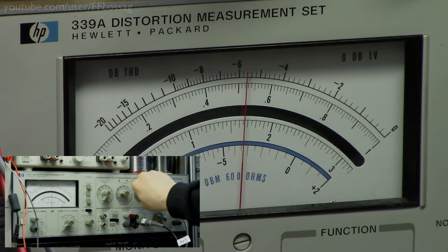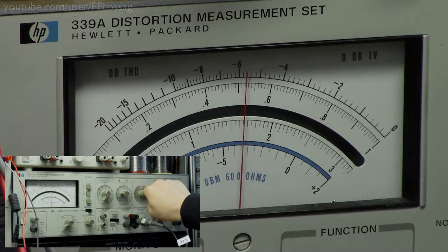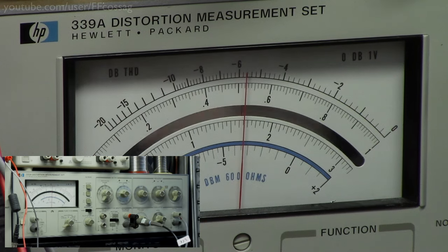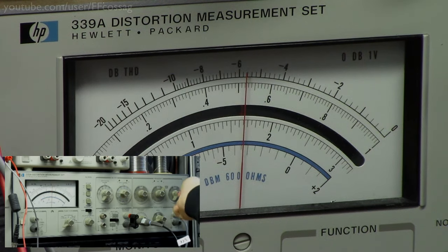Let's just get straight to 200. Yeah, we're down just about 3 decibels at 200 hertz, 3-4 decibels, so that's not very good. This is more of a woofer frequency response than a subwoofer. I mean, at 200 hertz, that's not a very nice sounding subwoofer at all. You really want to cut out somewhere around 100 hertz. And you want to be down more than 3 decibels at that, and let's just see...